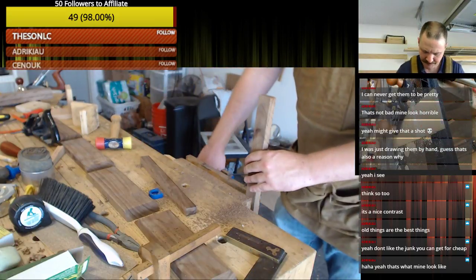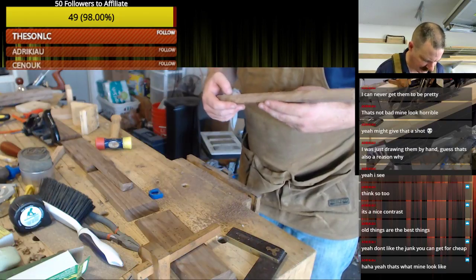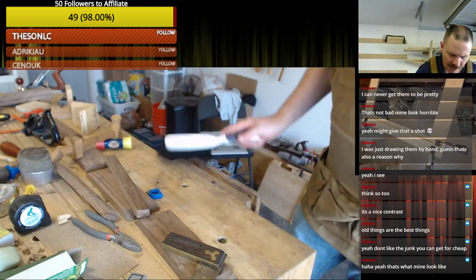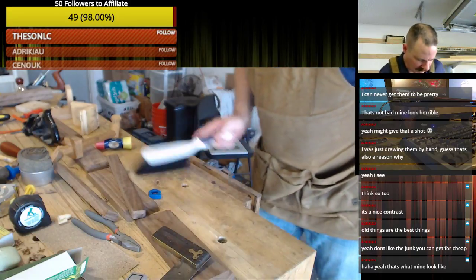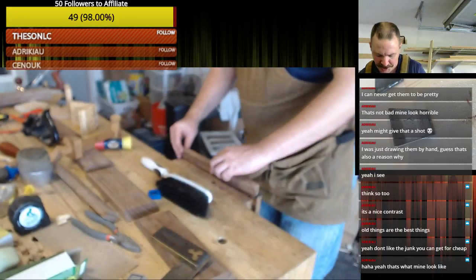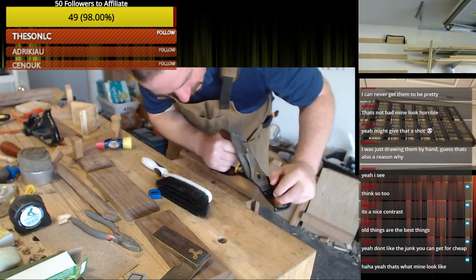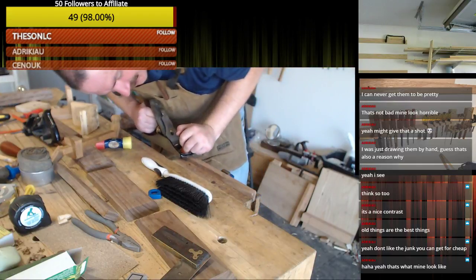Closer at hand. I've got a rack on the side of my bench. Wait a minute. That's the one I wanted to keep, not this one. Okay. Keep your wood in line, keep it sorted properly. Now, I've got two panel saws right there hanging from the side of the bench. One's a crosscut and the other's a 4-tooth per inch rip saw. That was the first rip saw I had, so that's why I put that there. But I find I'm not really using the 4-tooth as much, because I got this new guy. This is about 17 teeth per inch, so it gets a much finer cut.